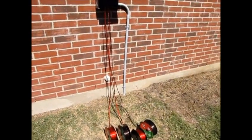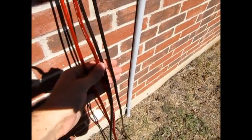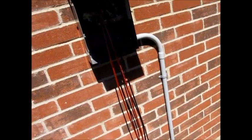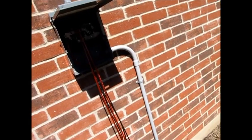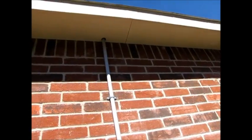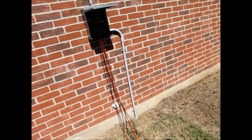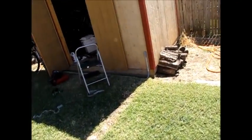Here we have the four lines run. There are going to be two runs that go deep into my attic. This is 8-gauge wire. Basically, I'm going to be pulling these up from inside the attic and then buttoning this up. I'm going to seal that opening so no critters can get in, and then it's done. Once this is done, it'll be completely rainproof and able to power my house with about 40 amps worth of power from my solar panel system. Hopefully you guys have learned as much as I have. Thanks for watching.